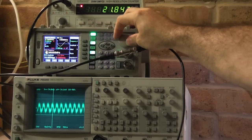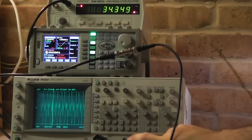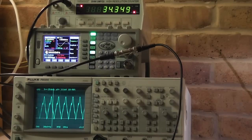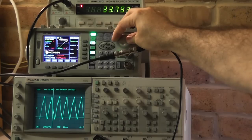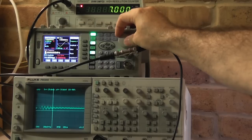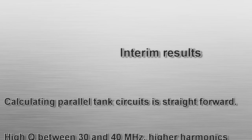Continuing the sweep, it goes down at 20 MHz, then up again at around 29–30 MHz, and there's quite a strong response. The trimmer makes a lot of difference here, and we're talking about 34 MHz — which is quite significant. Bearing that in mind and assuming that a higher capacitance will bring the frequency down to where I need it, I will proceed to adjust capacitance accordingly.